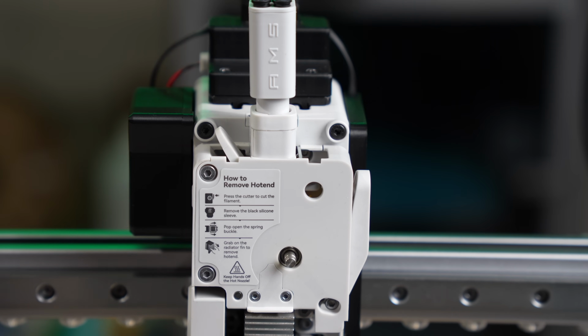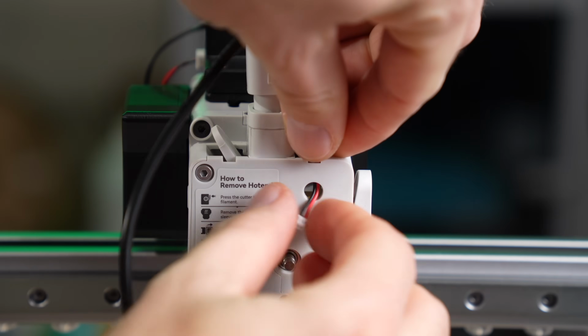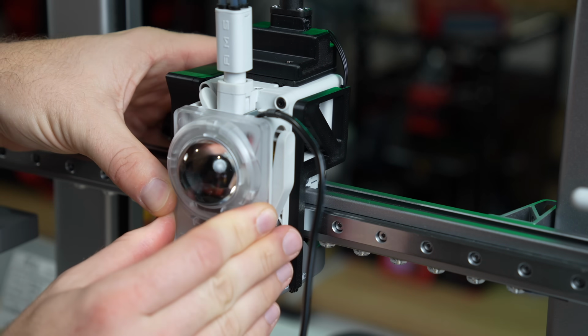At the top front right of the extruder is a small opening, and that's what we'll use to fish the power cable through to Knomi. Plug this into the back of the screen, then pull out any slack and install your new cover onto your toolhead.